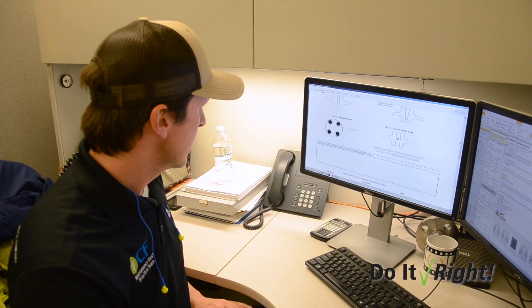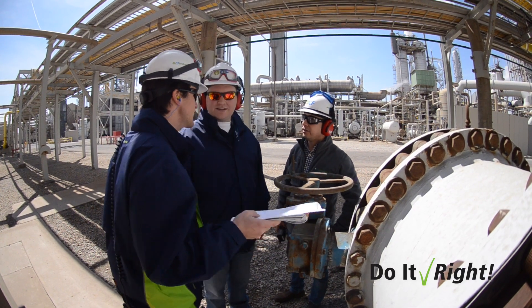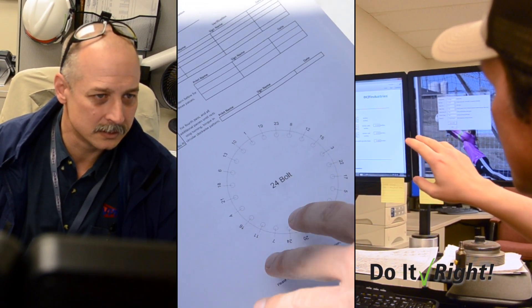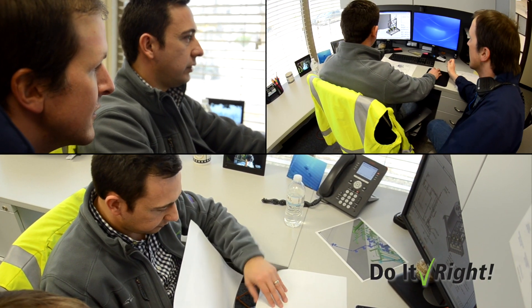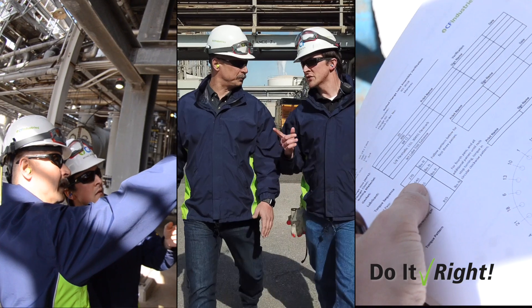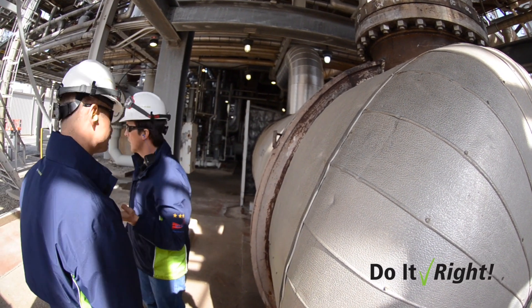With this program you have your torque step, your star pattern, then your circle pattern, and then sign-offs by the person doing the work. Once that sheet is made for that flange, all you have to do is go to that folder and everything's there — you don't have to recalculate everything. It helps take our technicians step by step through the process and gives us accountability for every flange being worked on. Since we implemented this program in the latter half of 2017, we've had a leak-free startup in each plant.